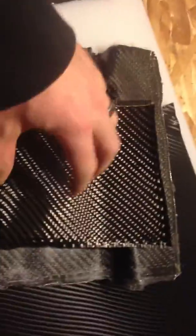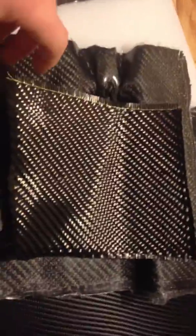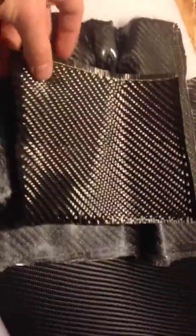I pull vacuum on it really tight and then I pull my resin through using the vacuum to totally soak it. Then it cures in just a matter of about eight hours — that's just the specific resin I use — and then I've got my part made.